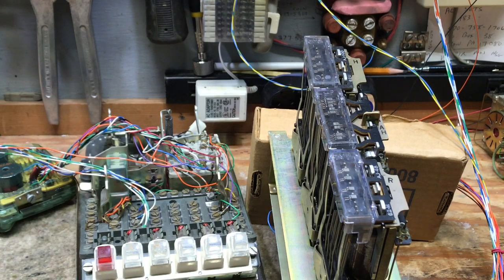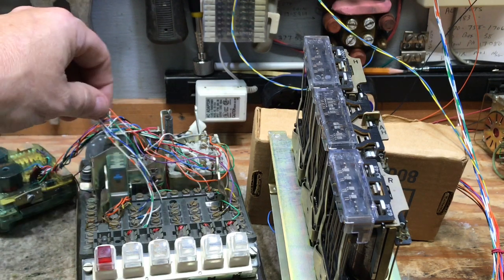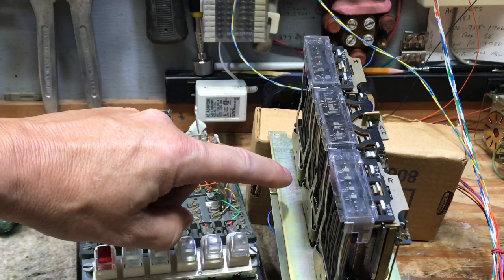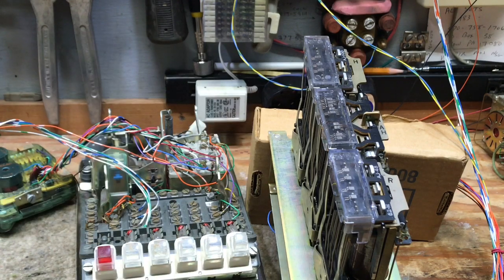So I have a 2565 that does not have a mounting cord on it, so I have actually wired up the wires directly from line 1 of the key strip over to my 202 KTU. It would be exactly the same electrical principle if we had a mounting cord, a cable, 66 block, all run to a central location, and then the KTU is wired to the cable. I've just gone directly from the KTU to the phone.